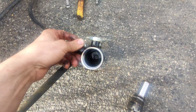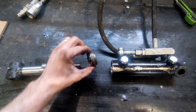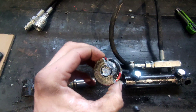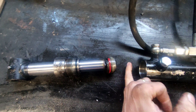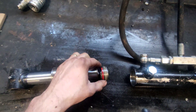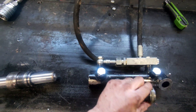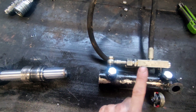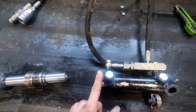I'll talk to my boss and see what we can do here. I'm in the workshop now. I removed the piston from the hydraulic cylinder — you can see it's damaged, it's broken. So oil comes from one side and pushes the cylinder out, or from the other side and pushes the cylinder in. The problem was this piston was stuck all the way in the back, so from whichever side we got oil inside the cylinder, it would still push the rod out. That was our problem.